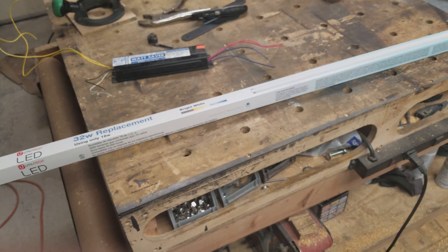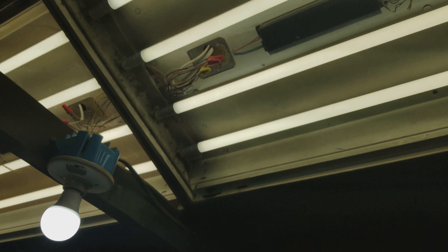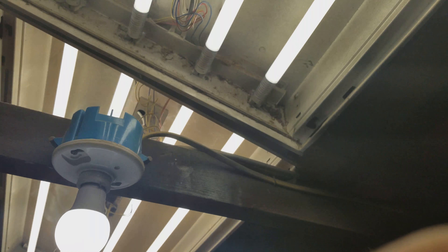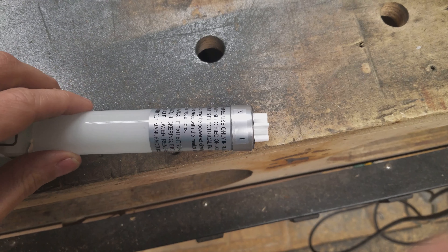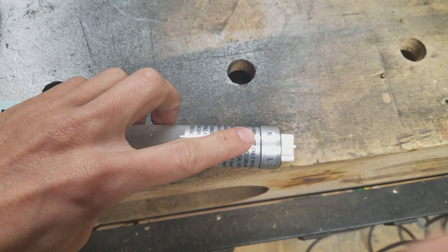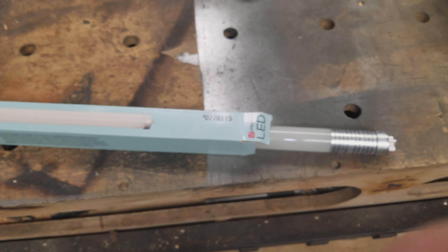Just make sure the power's off. Wire up one yellow, one red, one blue together — one set goes to your black, one to your white. On the end you're not using, tie them all together. Leave yourself enough wire to do that. Make sure you remove the old fluorescent tubes before you kick the power on, and make sure you check the neutral and load sticker on the bulb — different brands do the same thing, but it'll indicate which side plugs in to the power. Make sure that side is where your lines are tied in. If you have any questions, feel free to leave a comment. Thanks.